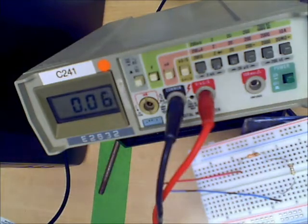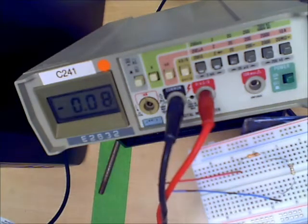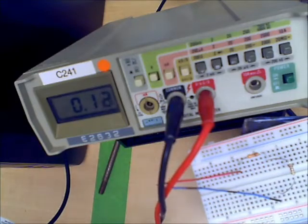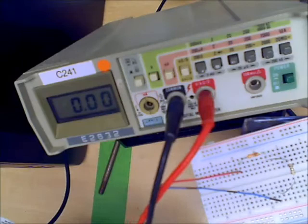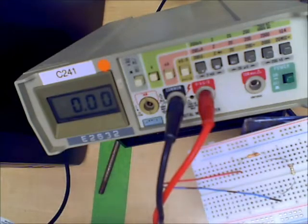As we continue in our series of making measurements with standard electrical engineering tools, we have our multimeter in front of us. This time we want to make current measurements. Last time we saw how to make voltage measurements. This time we want to measure current. And in order to measure current, we have to make sure that the multimeter is placed in series with whatever element you're interested in knowing the current of.